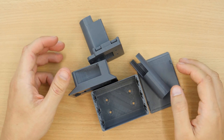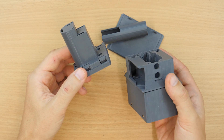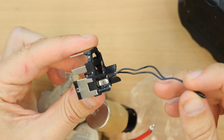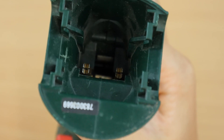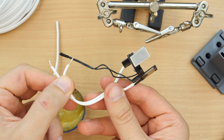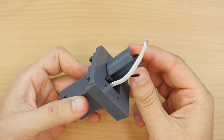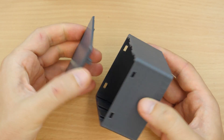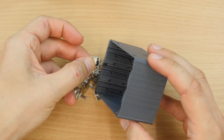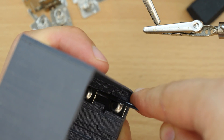The pack I designed consists of 3 main parts. The shaft is the part specific to my old drill — you could simply modify this one to your needs and reuse the other parts. I even took the custom connector from the old battery pack for simplicity. I left the thermistor unused in place. Fun fact: it wasn't used by neither the drill nor the old charger. We need to use thick copper wires for the main leads to get all the current through. This spacer will hold the connector in place. The bottom part is simply the battery compartment, which can also be used standalone for other projects. I bought some battery terminals and designed the case around them. To connect two batteries in parallel, I solder the terminals pairwise and put them in.